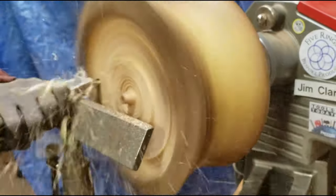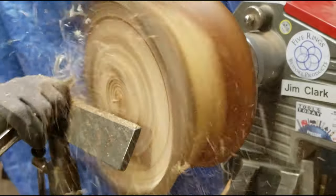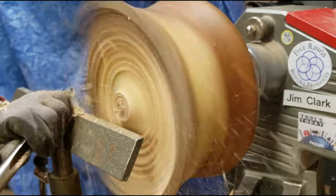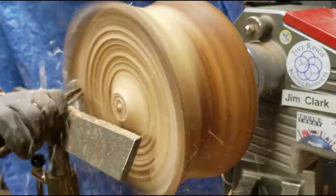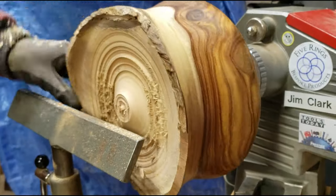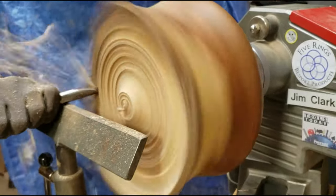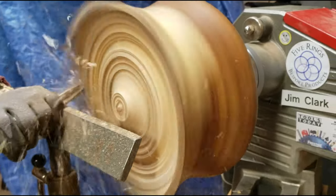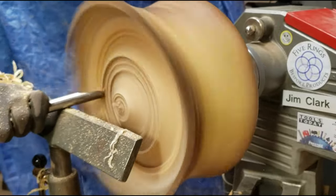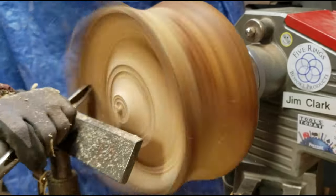If this is your first time seeing me do this, I'm rotating the headstock so that I can more comfortably get the bowl gouge in there. You have to keep the bevel of the cutting surface in contact with the wood as you cut, and if I'd kept it the other way I would have had to reach really far over the bed of the lathe — awkward and uncomfortable. This allows me to turn more comfortably and get all the way to the bottom of the bowl.